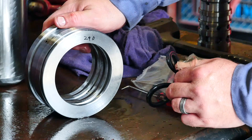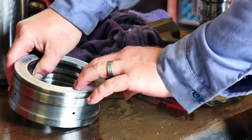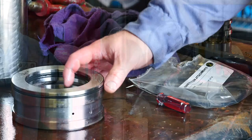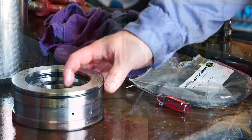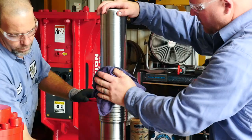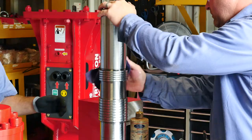Once you have replaced the hard seals, it is time to put in the last seal at the top which is the gas seal. Replace your rubber o-ring around the outside of the cylinder bush and now it is ready to be reassembled. Before you reinstall the cylinder bush, check the piston for scarring. If you have scarring on the piston, the piston can be polished as well.